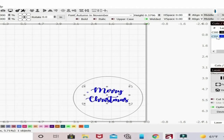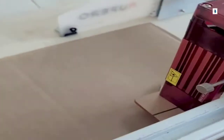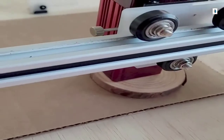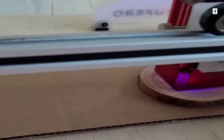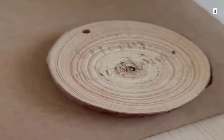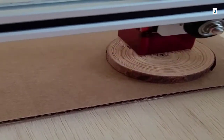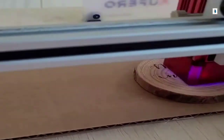I'm going to change that to a fill and change the power. They do give you a guide for power, which is good. We've got our circle. We're going to put our focus tool on top of our wood slice, tighten down that laser head, then remove that focus tool — and we are ready to start engraving. It's not bad for my first try, but I do want it engraved just a little bit darker, so I'm going to repeat that process. As long as you don't move anything and you just hit start again, you'll be just fine. And now that second try is much better.